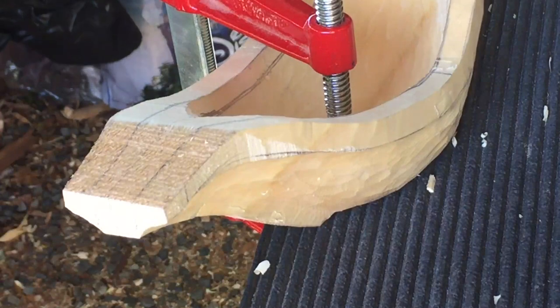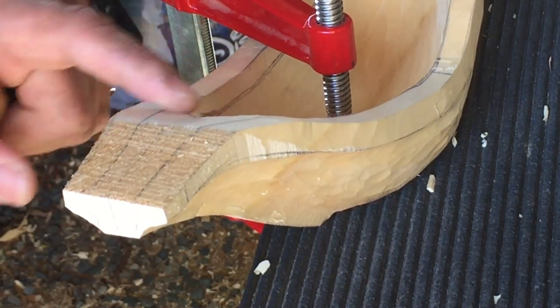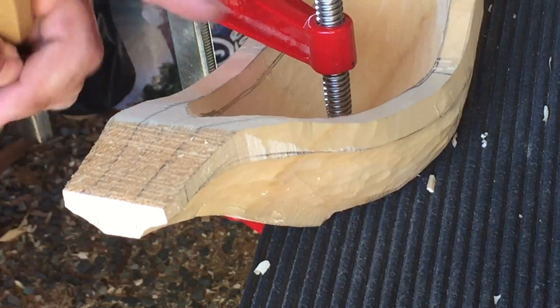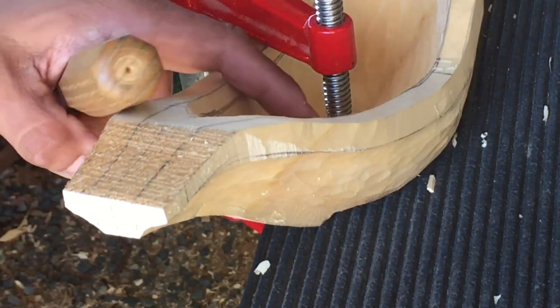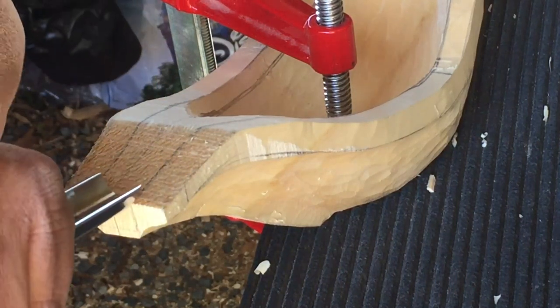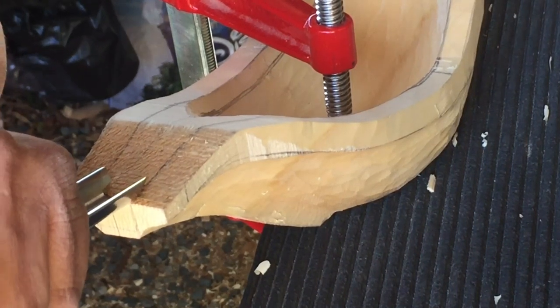So when I'm working on this, I'm working with the grain going this way towards the center of the boat. I've tacked it to my bench with an F clamp, and on the inside here I have a nice piece of rubber so I'm not marking the boat with the clamp. And all I'm going to do is line it up with the lines of the gunwale, and I'm going to follow the gunwale